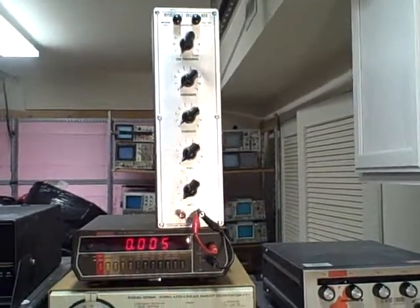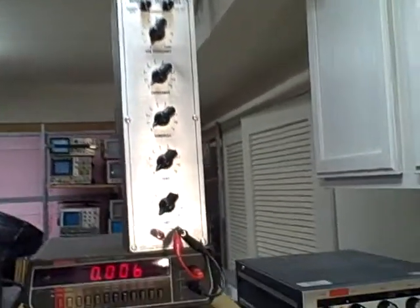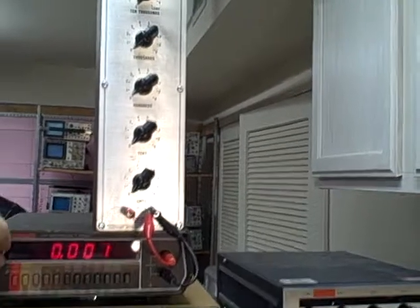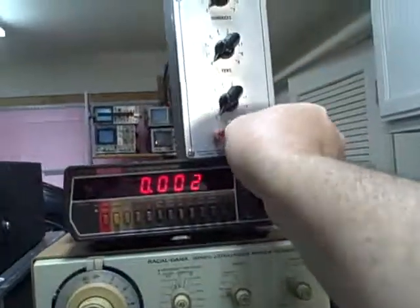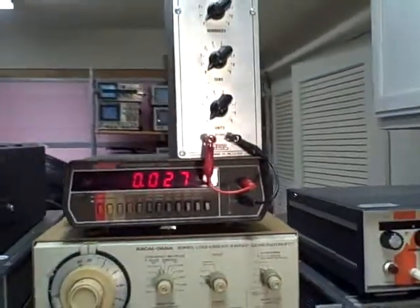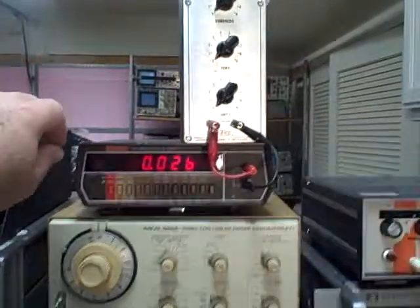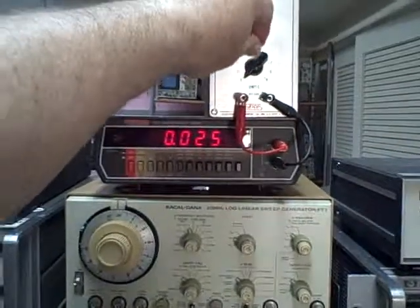All the ones I put in are three watts; I think the originals were two. They were all hand-selected one-percenters that were better than one percent. We're going to go ahead and measure the response right now. I'm zeroing out the resistance meter and then we're going to connect it across the resistance points. We can see we have 0.026 ohms of resistance in the wiring and switches to start with — that's at zero.